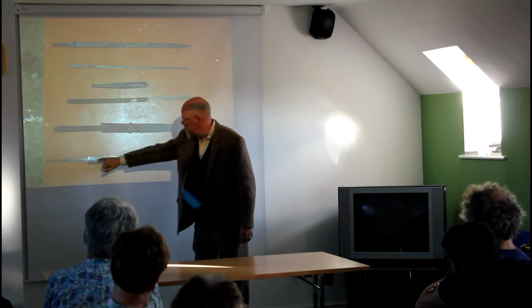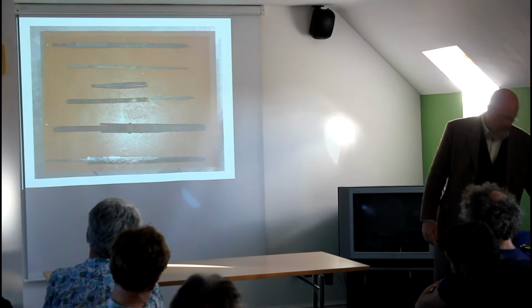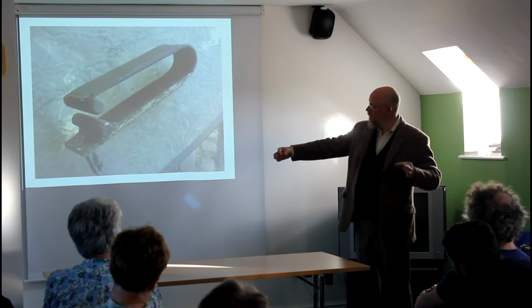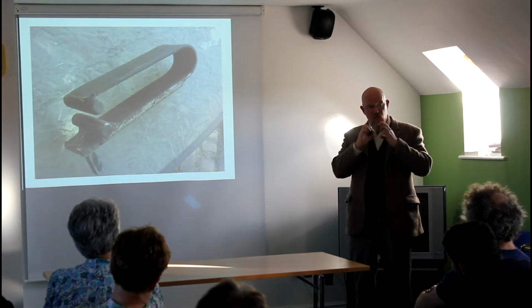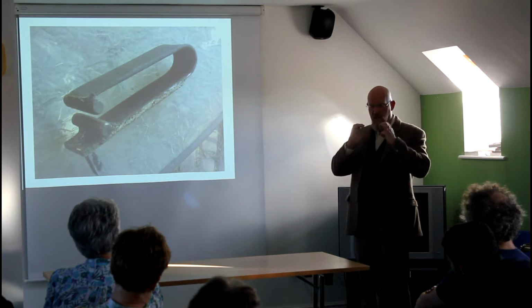with the fullering about to begin in there. So you've cut it to blade shape into fullering. Fullering is basically putting a channel down the middle of the blade on both sides. And it gives you a structure that's like an I-beam. So you have the strength of something like an I-beam that you use in construction. So you've got elongated sides and a narrowed middle.